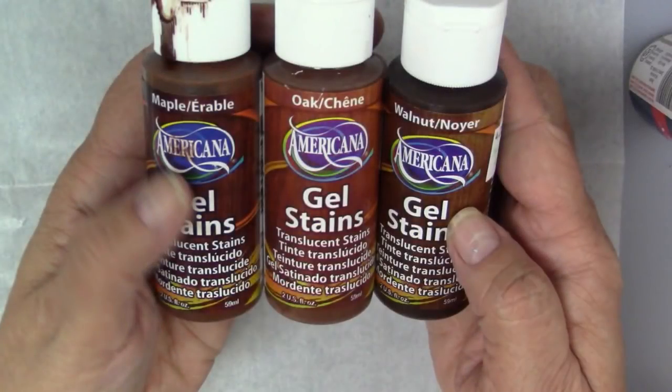You don't have to do this — it's just my personal preference. And then we've got these pretty stains. You can use any kind of water-based stain that you like. I'm saying water-based because we're using a water-based paint, and I like to keep everything consistent in terms of the base, the paint, and what I'm going to varnish with. So I want to keep everything water-based.